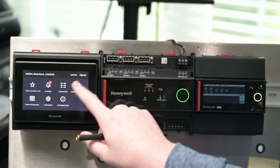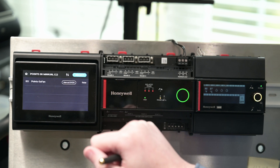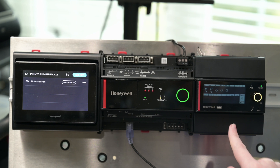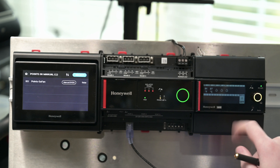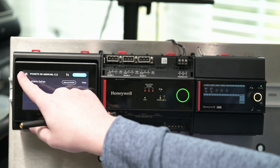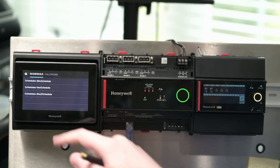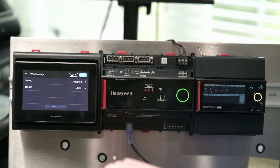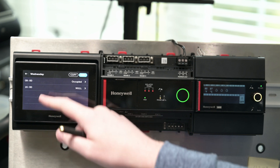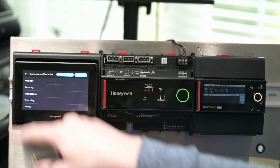I can also see points that I have in manual currently. You can see that this binary output was set from a hand/off/auto on the IO module — the DO showing the little hand means that it's in manual. We'll get to that in a second. Then we've got what they call time programs — basically your schedules. Days of the week, you can pop in and edit these with the values that you want for specific times as you need to.